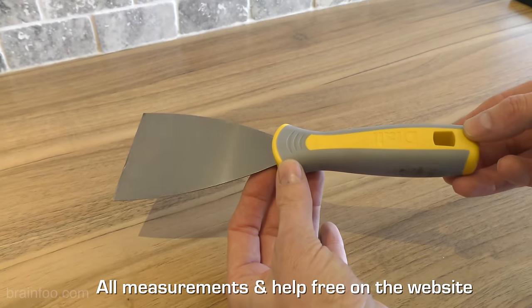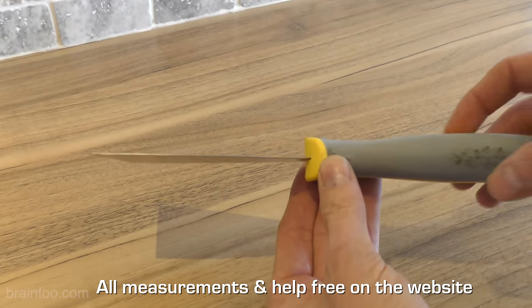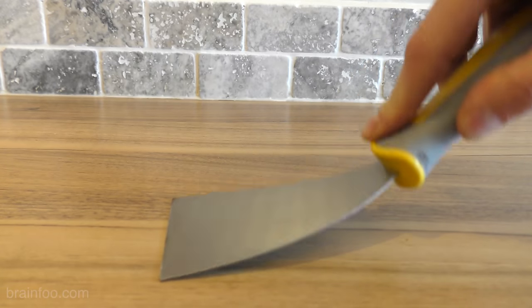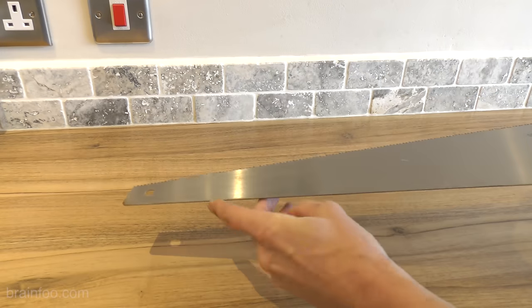The blade was sourced from a cheap paint scraper or wallpaper stripper. This has just the right amount of hardness to be cuttable and still hold an edge, whilst having enough flex to avoid snapping. In fact, if you have one already, you can chop the tip off, make a sword, and still use it as a scraper afterwards.